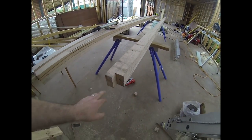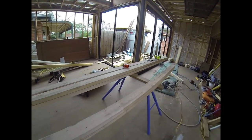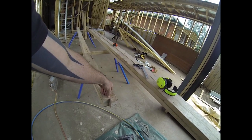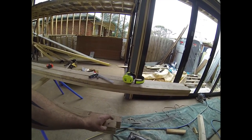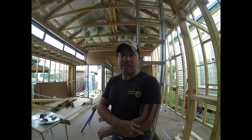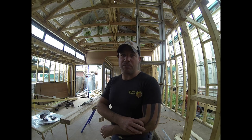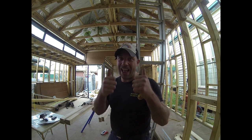We've got a halving join at one end and a halving join at the other end, and we're joining exactly half over the stump. Otherwise we would have done a tooth cut, but it's just really hard to do a tooth cut under a house — that's the only problem. If you've got any questions about our bearer joins, we've got a full segment on bearer joins that shows three different types. There are a number of different types you can use, but those are the three main types we use these days.